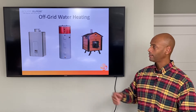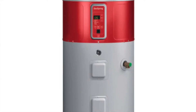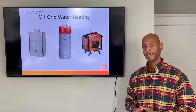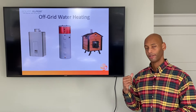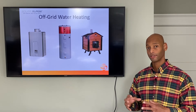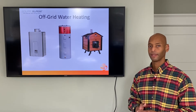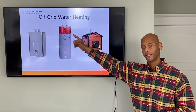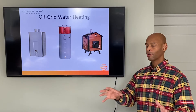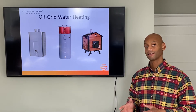The second option is called a heat pump water heater, sometimes called a hybrid water heater. In appearance it looks like a traditional electric water heater, except the difference is in the top quarter or so of the unit. Instead of using a resistive electric heating element like what you have in a traditional electric water heater — which can draw over 4,000 watts when heating and really tax your solar and battery system in a grid-down environment — the hybrid water heater uses a heat pump exchanger system. Think of it as a mini heat pump that draws heat from the ambient air and transfers it into the water tank, resulting in a much lower draw — in most cases less than 500 watts.